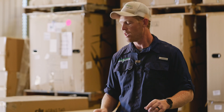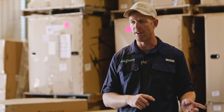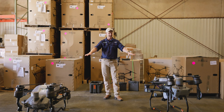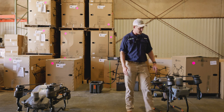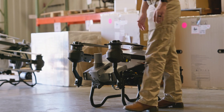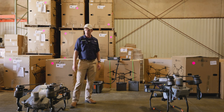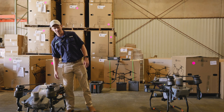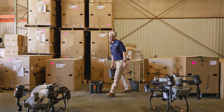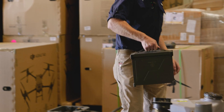Let's take a look at both of these drones to show you what the differences and similarities are, and why you might choose a T25 over a T20P. First off, you're going to see a difference in size, and size is really only height. The T25 is going to be a bit taller than the T20P — by about six inches or so. That's the height of the props off the ground, the height of the tank off the ground, and the height of the battery going into the drone. With the T20P, filling the drone, you kind of have to bend over, but it does make putting a battery in there a little bit easier than a T25.